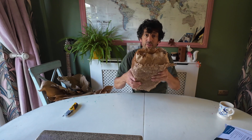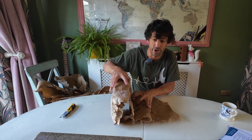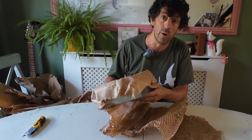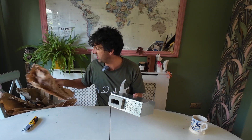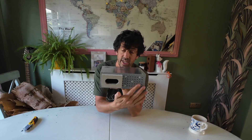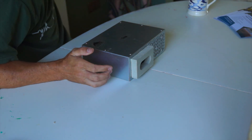Right in here we've got a swift brick. Lots of people have heard about swift bricks but never seen one — now you're going to see one. These are absolutely brilliant for new building sites; they can be laid simply by the bricklayer. This one in particular has got the EML on it — the expandable metal lath — and that has been designed for going into a building and getting rendered, because the render will stick to that bit and it'll blend in. All that'll be on show is this little hole here.